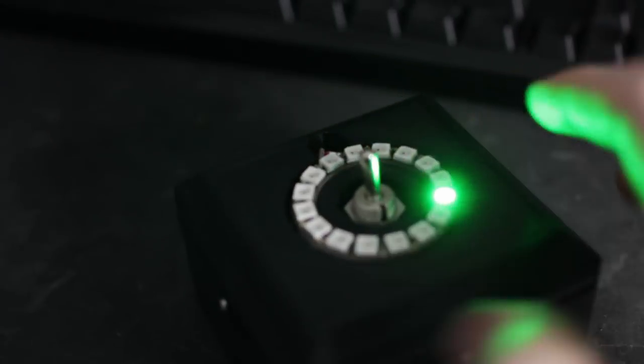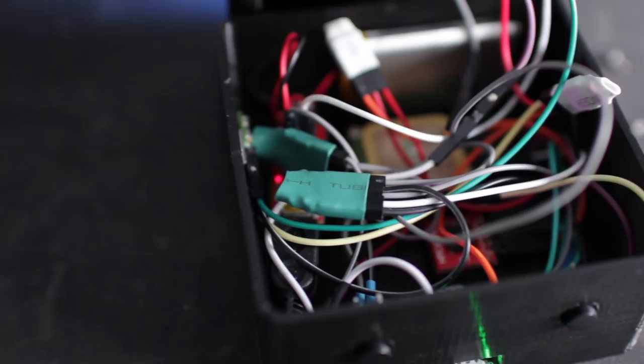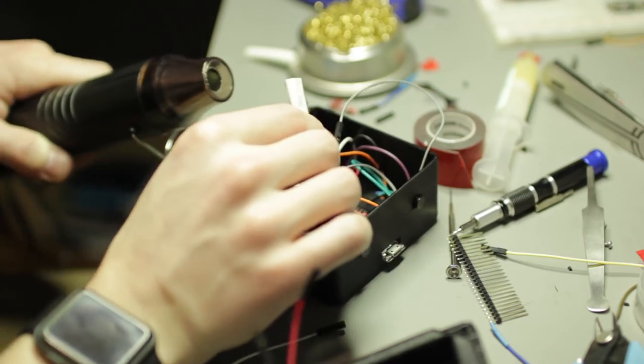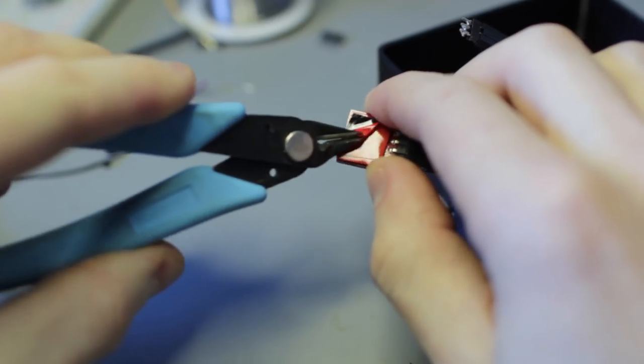We have it all assembled — the lights are working, the compass is working, the GPS is working, and it charges from the one port on the back. To assemble it using only jumpers, I had lots of ground connections plus 5V and 3.3V lines, so I soldered headers onto some headers to connect them all together — still not soldered to the board so I can take it apart later. I also covered them with heat shrink tubing so they can't short out, which is definitely necessary.